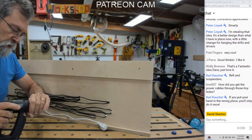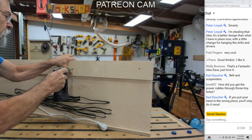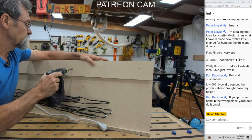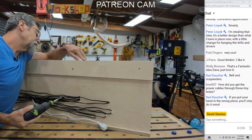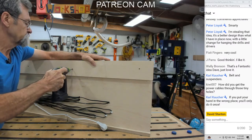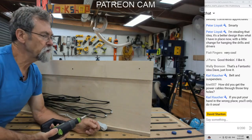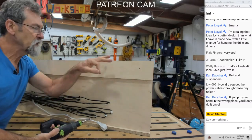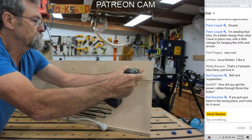Well, I think we need to go a bit deeper than that. We can't have anything proud. It's got to be all the way in. So back it out, and then go again. I've set the clutch to 11 this time. Yeah, not good enough. I'm going to go full strength. Back it up first. Now in. Gotcha. There's no fear of these pushing further through and coming out the other side because, as I say, they're 30. This is 36. I've still got a quarter of an inch, 6 millimeters on the other side.